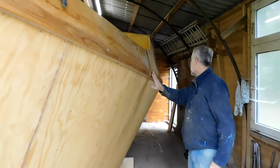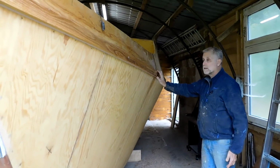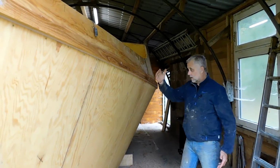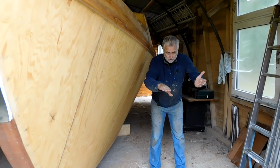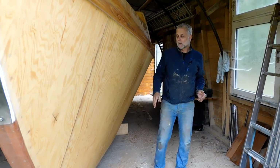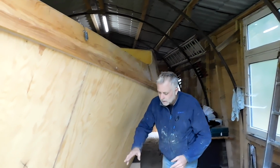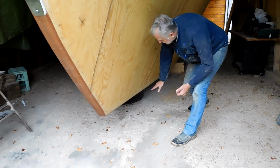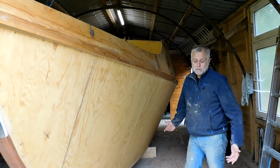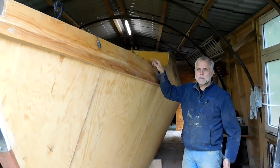Can you come and follow me around, Kerry? It starts to curve out a bit fuller here, back to midships. So 31 foot 8 long, 10 foot wide at the maximum beam. But obviously hard chine, so we've got these straight lines down either side, and a flat bottom as she stands at the moment. There will be a keel, a full keel, or perhaps a 3/4 keel is a better description, that starts from this point down here and will angle back to the depth, flat bottom keel, which gives us a draft in the region of 3'6".